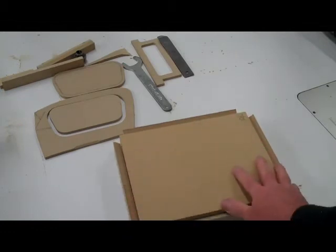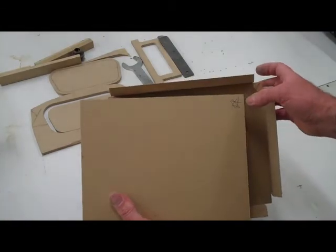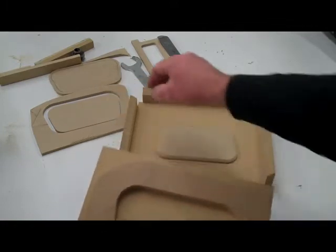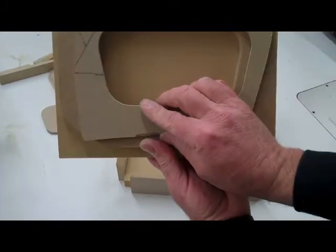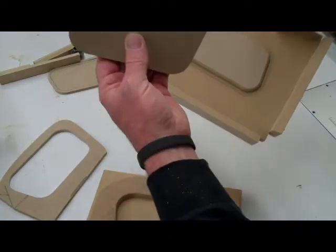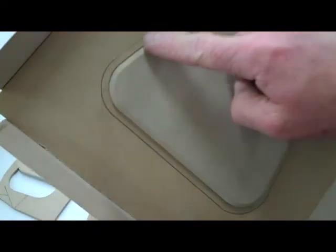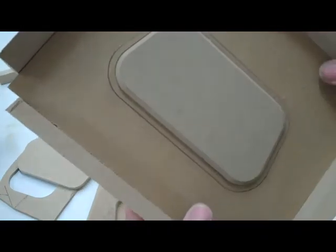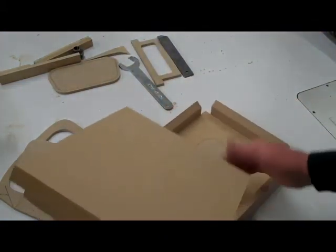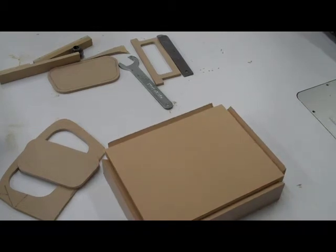So I have this jig that I threw together, and very importantly, you see I've got stars to match the corners, so I always get them lined up. And inside I just have a piece of scrap wood with this larger cutout, and then flush cut to make sure it was the same. And then I copied this small piece, and I made sure to chamfer the edges so it doesn't cut the mesh when it's stamping. And then I put on some little side pieces to keep everything centered when it gets pressed. So let's head to the press and see what happens.